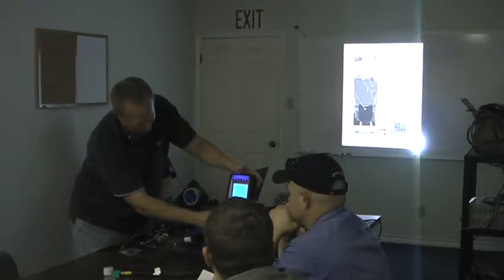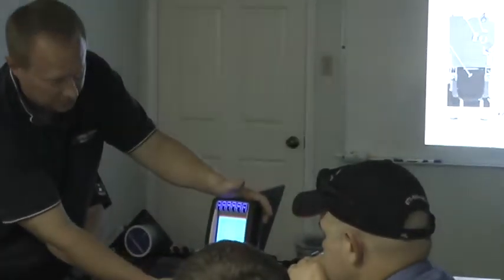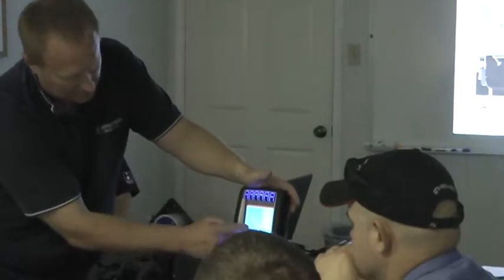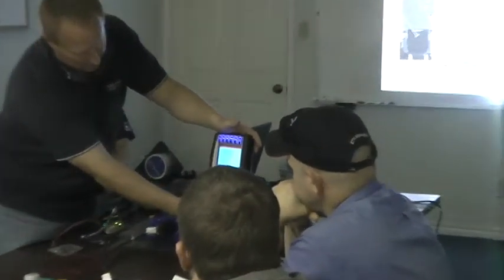Now, to confirm that, you can hit the check mark, or the rotary button here is a push. Now it's asking for your boom configuration. Just rotate the knob around to what you have, whether you're picking main boom, or 0, 15, or 30 degree offset for the jib. If you had a telly on it, the next step would have gone out to the telly jib, and then through the offsets.